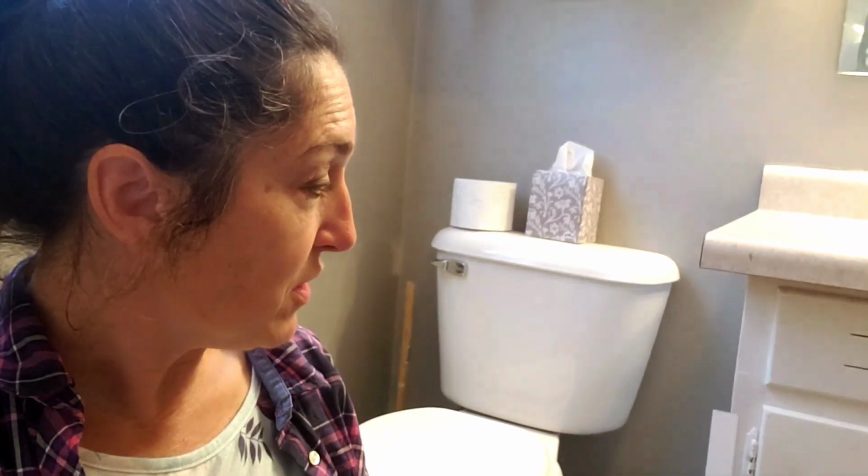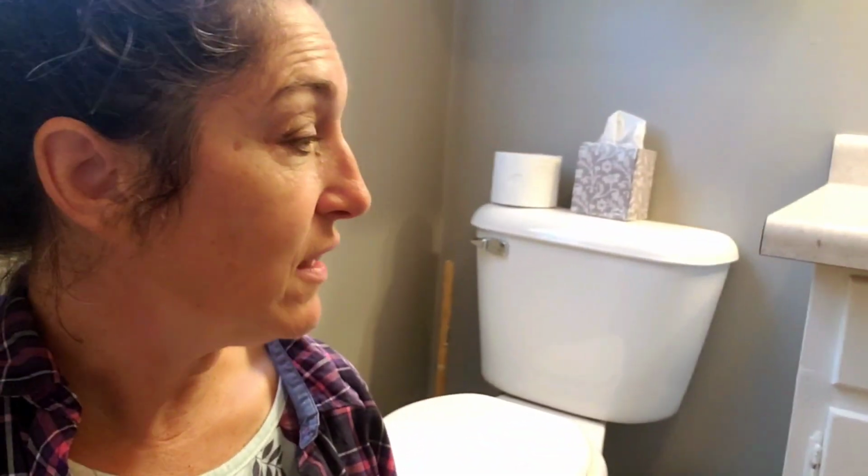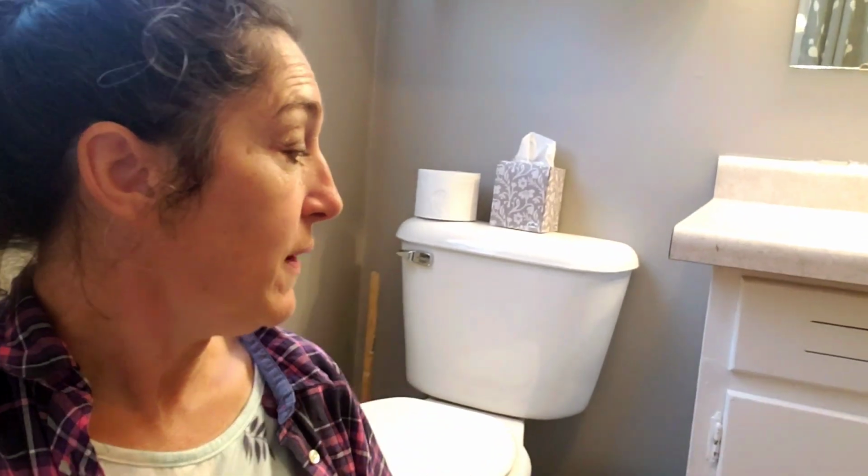I have some real tall ones behind me that I may add some extra sections to, to divide up the length of the cabinet. But brad nailer, I think I picked this up at Menards many years ago for roughly $20 to $30. Wood glue, and the length of brad nails that you require for this is 1/4 inch plus your plywood or your cabinet that you already have.